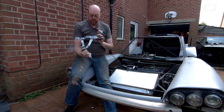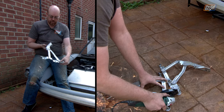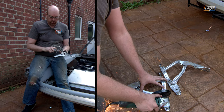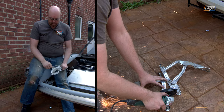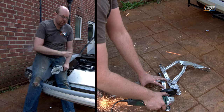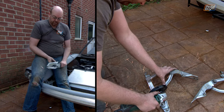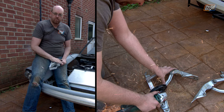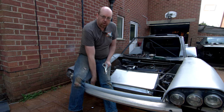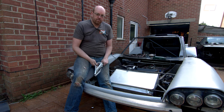We can cut the mount at the very back off — that's the gas ram mount, so we can lose that piece and probably drill this mount out as well. Then we're going to build a frame that connects these two hinges together at the very front. There's very little flex in this anywhere, so we won't have much room for error. We keep these dead parallel, drop them in, bolt them onto the front, and then attach the bonnet and work everything out from there.